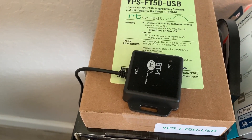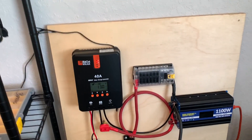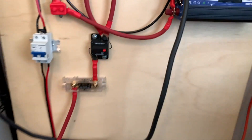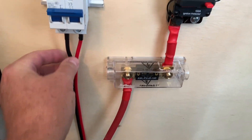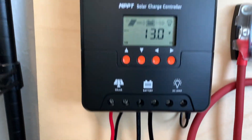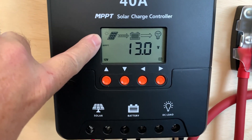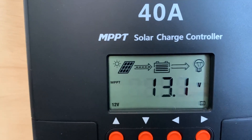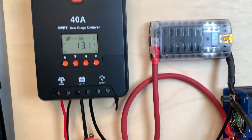I downloaded a couple of different apps so I can see how everything's going. After I got the solar panels connected — this is the power coming in from outside — I flip this breaker on, and immediately on the solar charge controller I started seeing the solar panel image. You can see the arrow is pointing to the right, which means it's feeding power into the batteries.